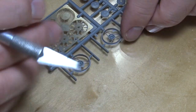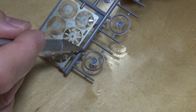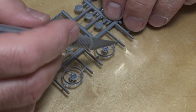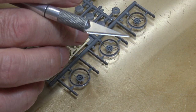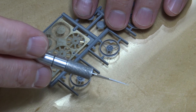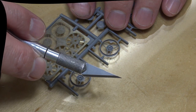On the radiator fans, it's easy because you've got the pair of motor mounts pointing toward the flats. So that's not a big deal. So anyways, I'm going to cut these off. I'm going to clean up the perimeter on the outside. I'm going to glue them into the shell, and then I'm going to come back and scrape the mold parting line on the inside. Again, always use a brand new sharp blade to do this.